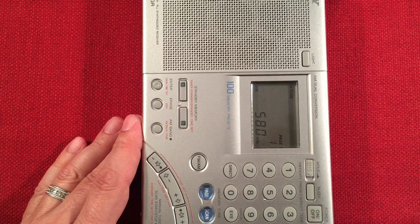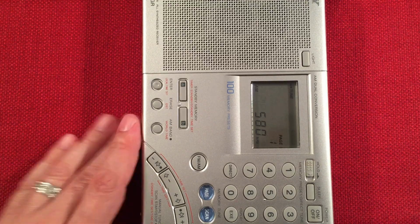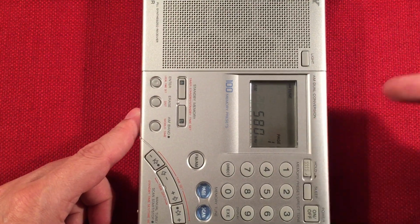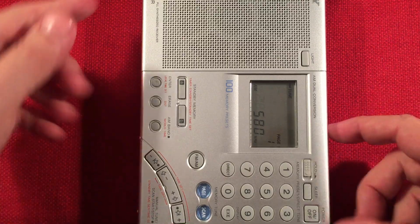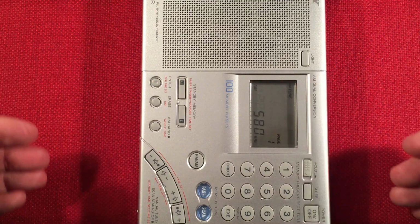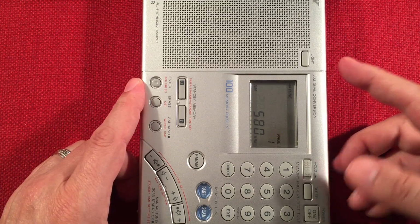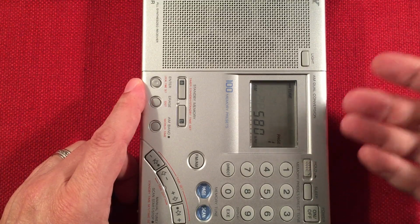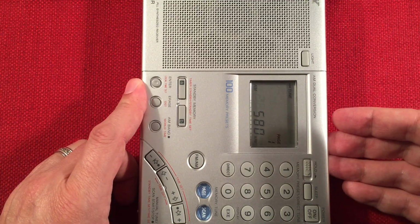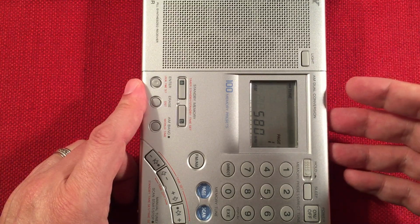Okay, this is 580 WILL, Urbana, Illinois, about 150 miles south. This is an NPR station. Now, this is technically north, but that horizontal edge works in both directions, north and south, which is nice. So if I point it west, which is that way, I also pick up east stations too. Something to keep in mind. It works both directions. So 580 is coming in clear. Now, the current time, like I said, is 11:09 a.m. Central Daylight Time. Sun's been up for about 6 hours. We're close to daytime, to give you an idea, so we're not picking up any evening stations.